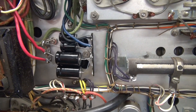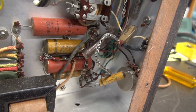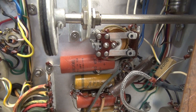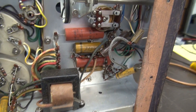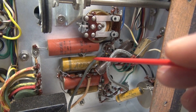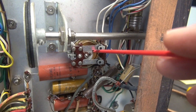When I did that I was able to fire it up and it did transmit without blowing the fuse, so obviously we had a bad cap — that's a good thing. Now, push-to-talk: remember I told you about that two-pin mic jack? Here's the back of it. It looks pretty well done — whoever did it did a neat job. Here is the push-to-talk relay right there. I'm not really sure where he tied in voltage-wise to operate that relay. Upon closer inspection of this push-to-talk relay I see this big resistor here, which is not typically in a Johnson Viking 2. It appears as though he's pulled the high voltage off of this modulator preamp section, so there's probably about three to four hundred volts there going through that dropping resistor. This must be like one of those ten-thousand ohm coils on this relay like you'd see on a Ranger.